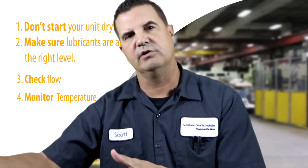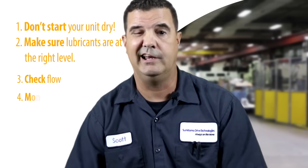Lubrication specialists will tell you that running up to 200 degrees is okay, but you'll be changing your oil constantly, and that's expensive. Temperature kills — everybody talks about speed kills, but in gearboxes, temperature kills. Temperature is typically the first indicator that something is going wrong. The temperature climbs up fast and doesn't stabilize, which is bad — like when somebody didn't change their oil. It doesn't take any time to check it. We just want to eliminate as much damage as we can by catching problems as quickly as possible.